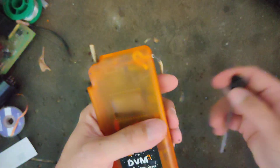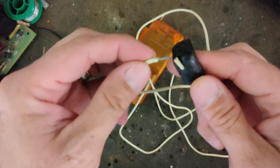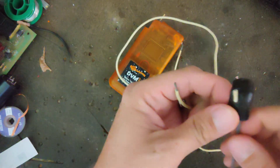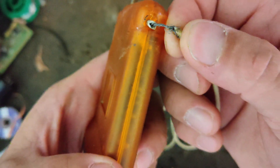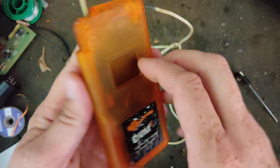So what happened here — the reason it was sent in — is that this broke: the ground probe wire broke off. There's a more permanent way that we'll fix it, and I'll show you how to do that. We're also going to fix where the ground probe comes out of the side of the case. We're going to take this apart and redo this so that way it isn't exposed and banging back and forth until it breaks again.